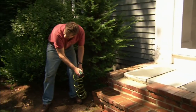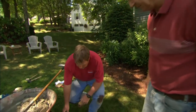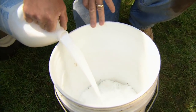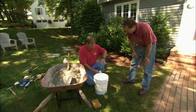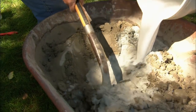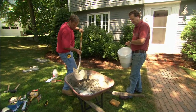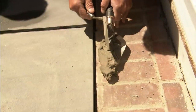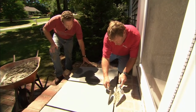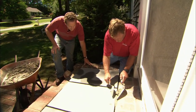That's great that you're cleaning up as we go along. Now I have to mix up one more batch of mortar for the joints. The mortar's the same, but to the water I'm going to put in an additive — that's going to make the mortar more flexible in the joints. Pour a little right here in the middle for me. We're just going to load up the big trowel, take the little trowel, and work this into the joint and pack it in. We don't want to get the mortar all over the place — be just as neat as you can. Fill the joint to the top and then we'll come in and tool it off.